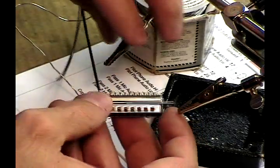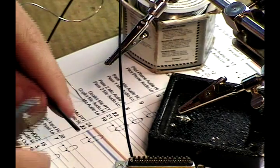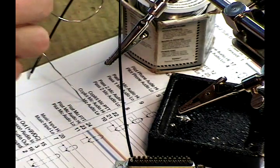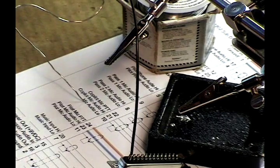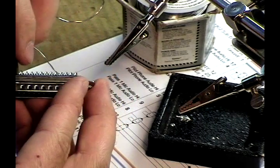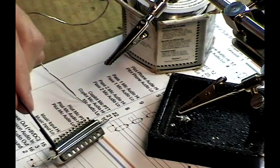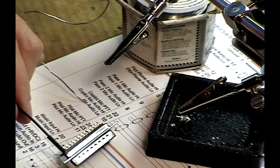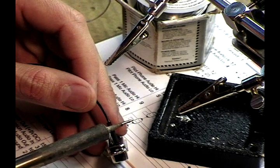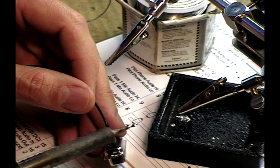To finish this connection, I use a short length of heat shrink. I recommend using 3 to 1 shrink ratio tubing if possible, and adhesive lined where practical. In the absence of a heat gun, I can actually shrink the heat shrink by using the iron.